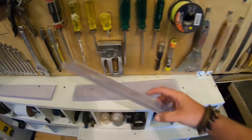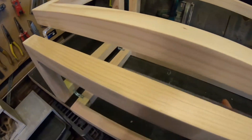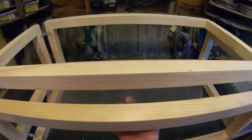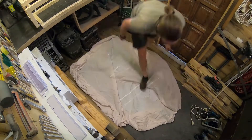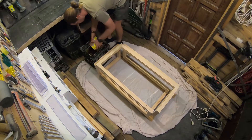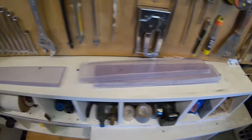I'm going to use those four pieces to replace these brackets here. So it's going to sit like that and once the plastic's off that should be nice and see-through. Before I attach those though, I'm going to give this whole frame a varnish - I don't want to get any varnish spills or anything on these polycarbonate pieces.